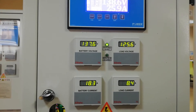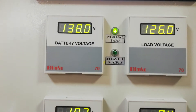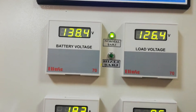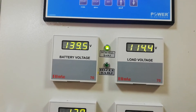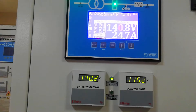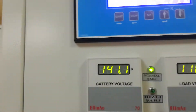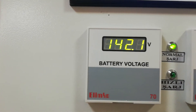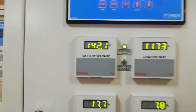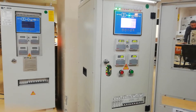Our aim is to keep the load voltage around 120V. Normally it is 110V plus or minus 10%, which is acceptable for the load side. The second dropper is also now in progress, as you can see. The output voltage for the load side looks better, and the battery voltage is 142 volt DC — this is for the boost charge operation.